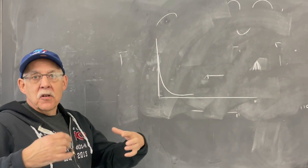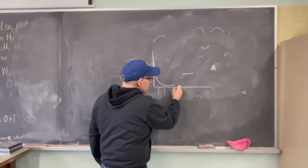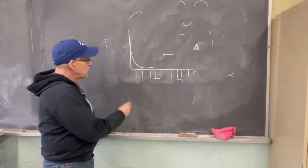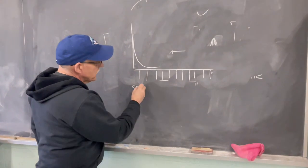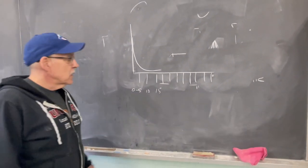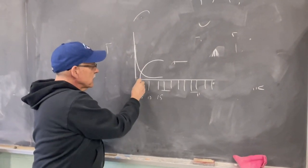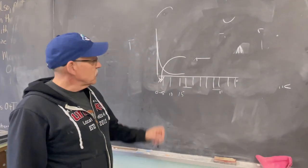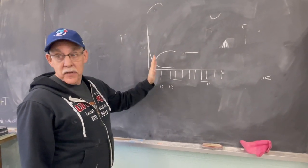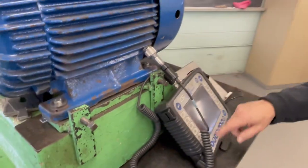Here's our spectrum — if I take a reading without enough settling time or I slammed it on too hard, I get a ski slope shape. The reason that happens is that when you slam the accelerometer on, everything's shaking and the box doesn't know where to put the data. The spectrum is divided into bins — the more bins, the clearer the picture. The bins are the same as lines of resolution, going from zero to five cpm, five to ten, and so on. The box throws all the confused data into the first bin, causing the ski slope.